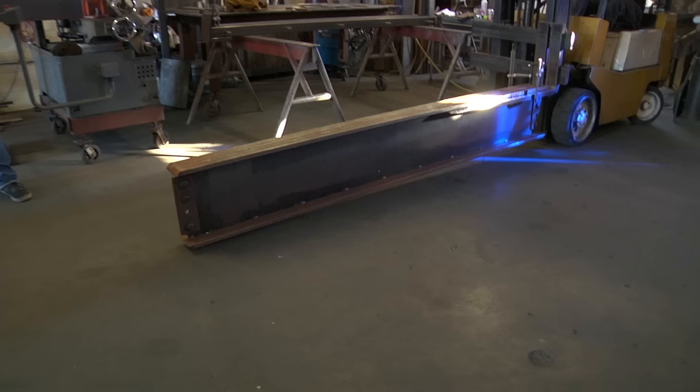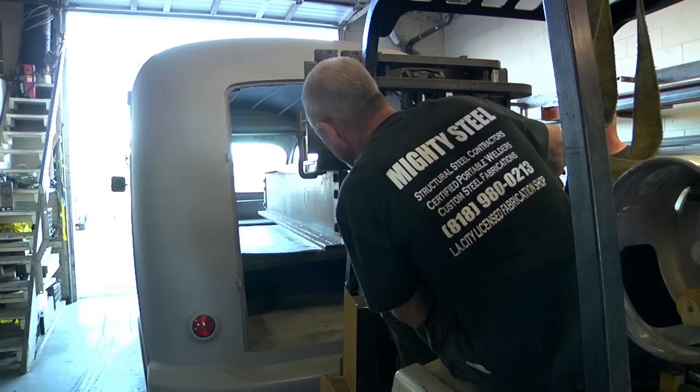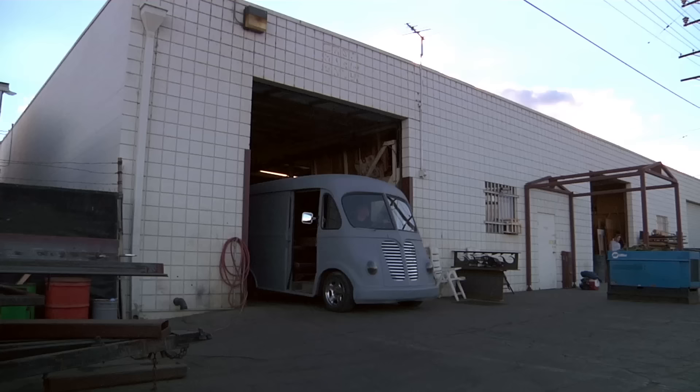The van's together. I got the airbags in — it's a driver. The big secret it's hiding is it's my old work truck — a 1988 GMC pickup truck. From the radiator to the gas tank I modified the whole thing, put this International body over it, so it drives like a modern vehicle. It's got a Vortec V6 with a manual five-speed and airbags all around. It's a bitchin' ride. I spent a lot of time on the structure of the fold-down walls — this whole hinge and steel mechanism I came up with has proven to work well. It's a utility vehicle. I still have this van — my friend Rich Evans is going to use it for his vintage flats paint company as a display vehicle.